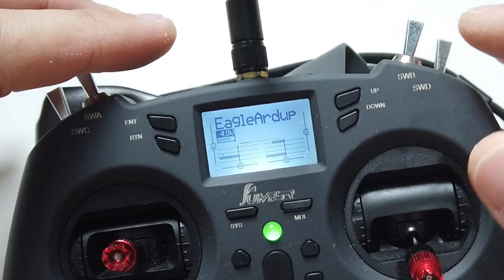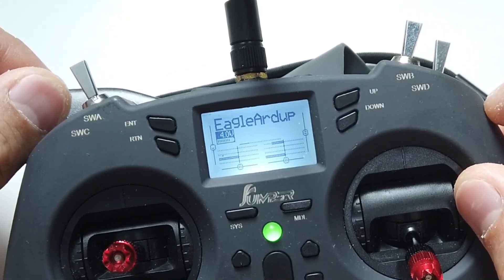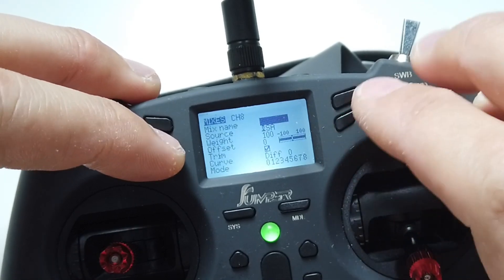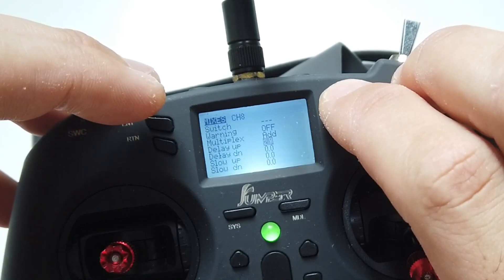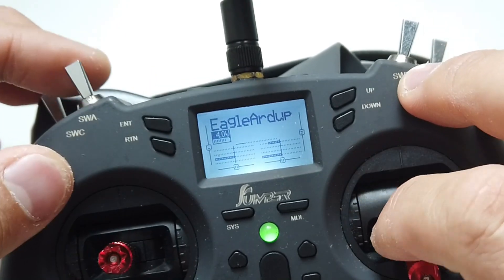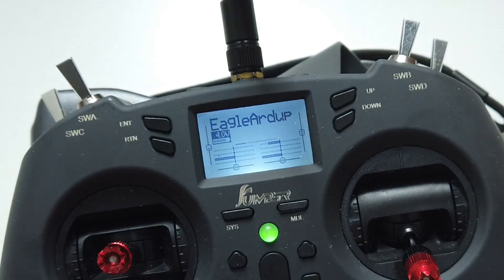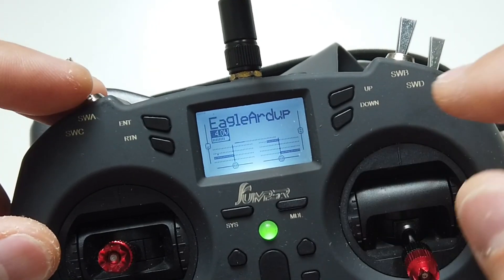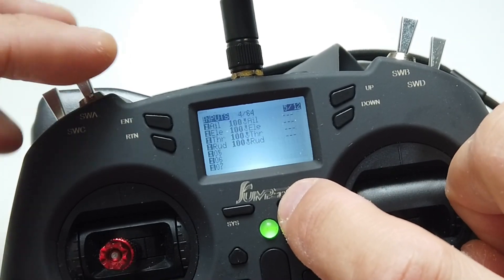You can use a three-position or two-position switch. My two-position switch is already used for flight mode change and manual motor disarm, so all other settings remain unchanged. You can add a delay - for example, it triggers only five seconds after you press the takeoff button. With this switch, once set to takeoff, it will warn you and then wait about five seconds before going to full 100 value to trigger the takeoff.